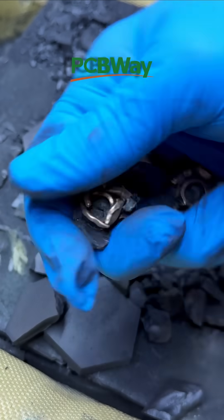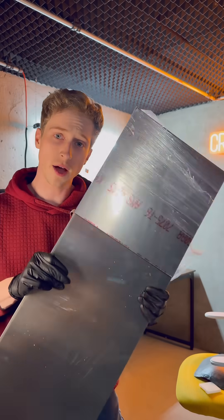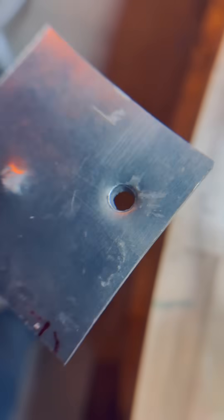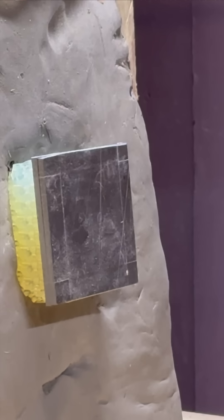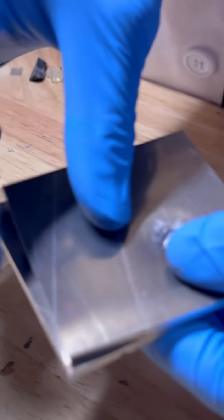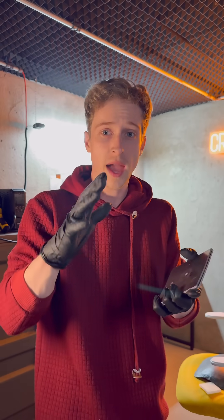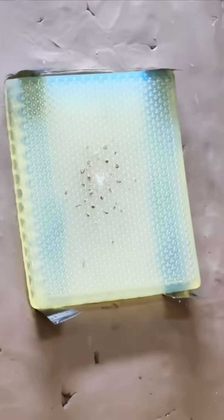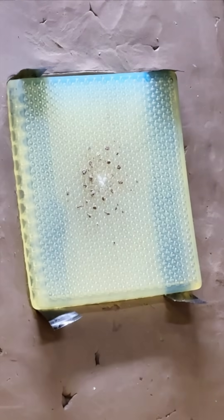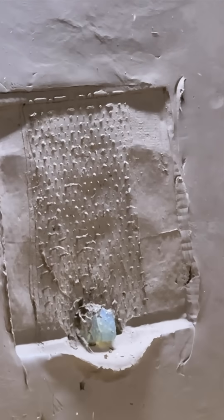If you're curious about the details, that whole video is up on YouTube. I have some 3mm thick 7075 aluminum alloy here — we found that a single sheet was insufficient for the 5.7, with it drilling right on through, but two layers was enough to get that stoppage. We did get a little bit of sharper back face deformation. This is where we see those lattices shine: they're able to spread that impact out and resist fracturing, so they can remain intact for further impacts while still having some ballistic capabilities, giving them a chance of catching a higher energy round after it's passed through these harder mediums.